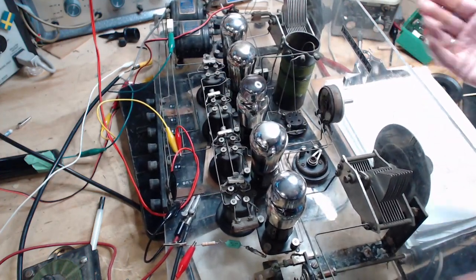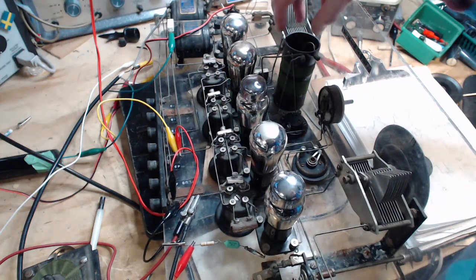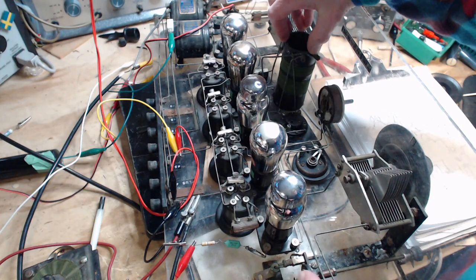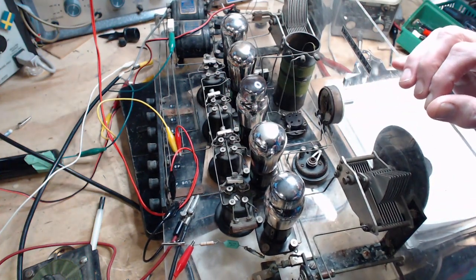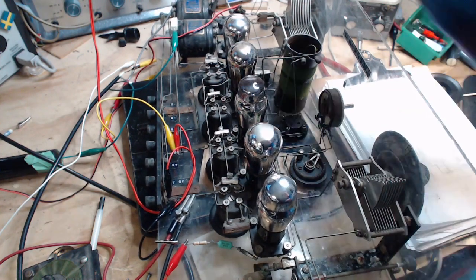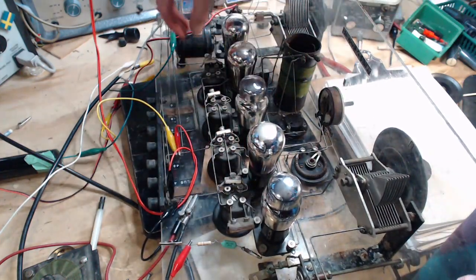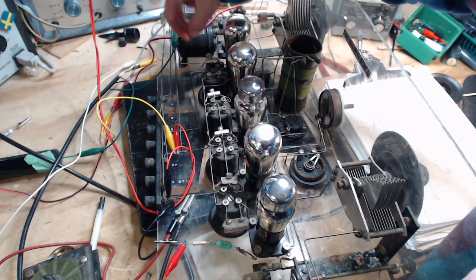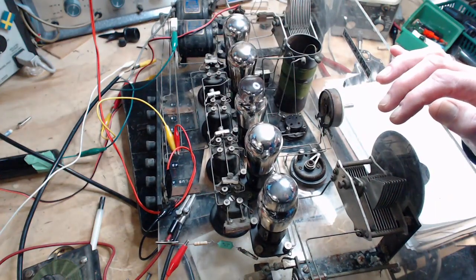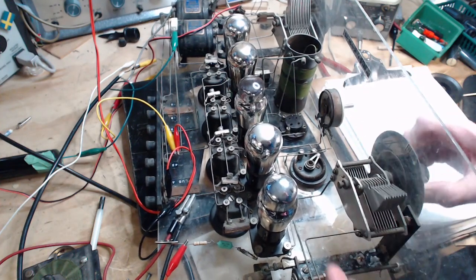And some simple things I can just try and see what happens. Operate the radio, try to get this local oscillator signal onto the grid of the first tube, along with an antenna signal, and hopefully something will come out down here. I hope there'd be enough rejection all the way along here that all that would be left is the IF signal down here. And it could start out very, very weak. It's bound to start out weak. All this stuff, just forget about it. This front-end tuning for now, forget about it.